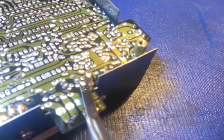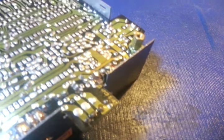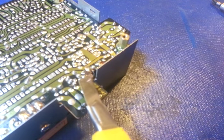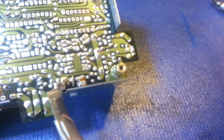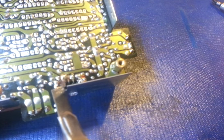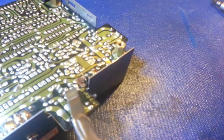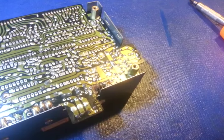and the flux cleans the surface, because that helps to etch it. Focus there a little bit, but you'll actually get a bonding of the solder itself and the copper, and that's the new metal. It's almost like it was either bad wetting action or it's bad copper. I don't know what it is. And why is this camera not focusing properly? There we go.